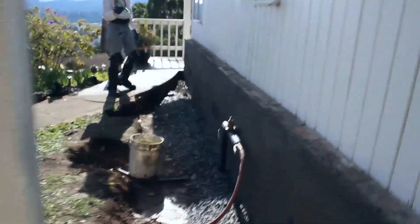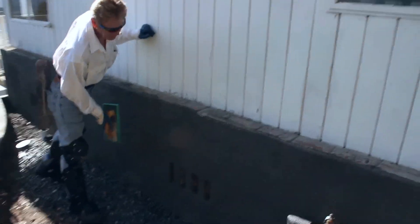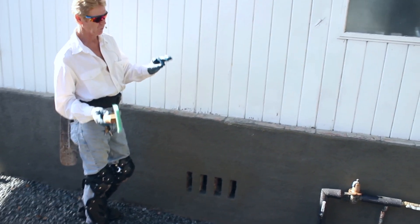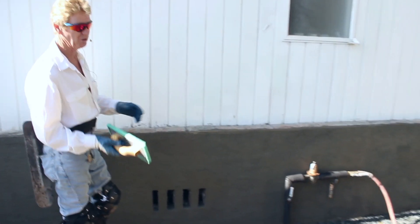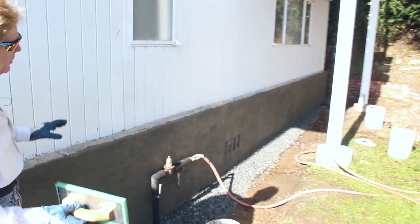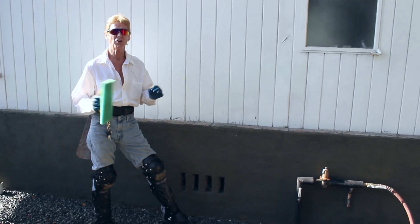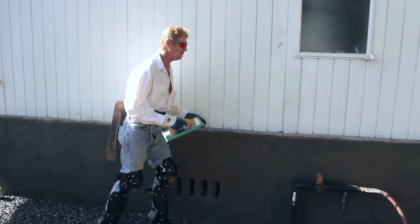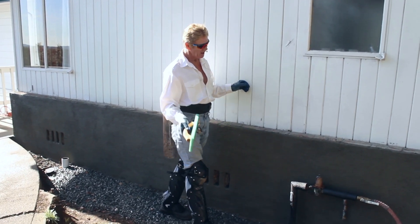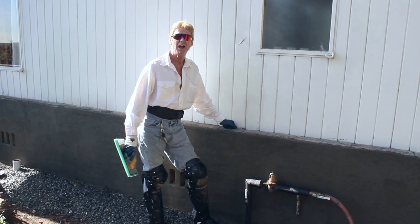We floated it with the green sponge float, made everything clean and plumb. This wall is pretty straight and perfect — the sand grit everything is uniform. But you don't have to do it this perfect. You guys could put trowel marks in it, put humps in it, do old world charm — have some imagination and make it look different than the house next door. My name is Kirk, Jason's on the camera, we thank you for watching, and as usual, live long and plaster.